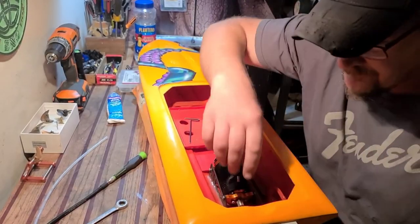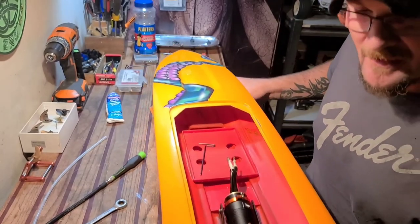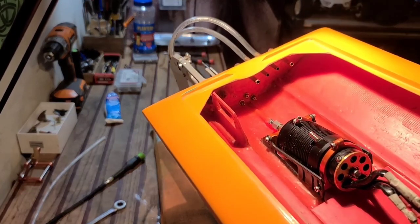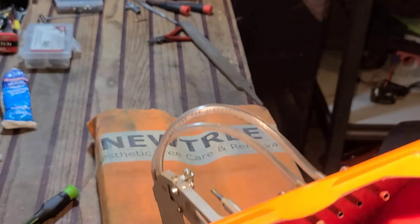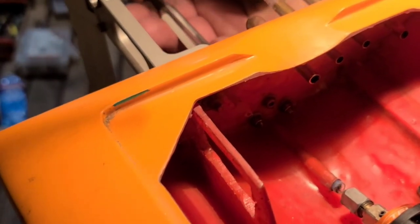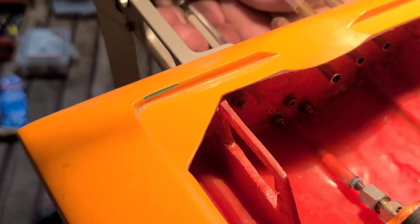Alright, I got the stinger all bolted up. It's all set. I've got everything actually lined up pretty nicely for me. Hopefully you'll be able to see this. I'm gonna try to hold it so that you can see it in this light here. There we go. Is that better? You can see that the flex cable goes into the stinger and comes out the tip, the stuffing tube, and then the Teflon liner, and then your flex cable lines right up with the chuck, the flex cable collet. But that's what it should look like from the inside.